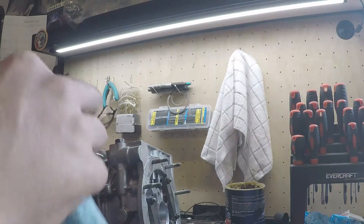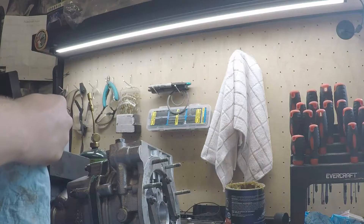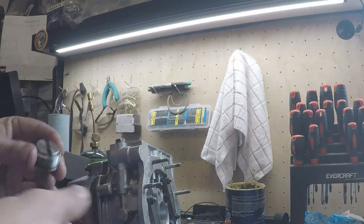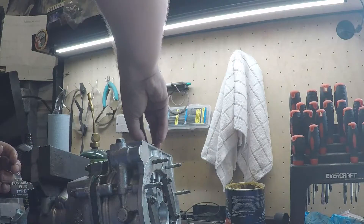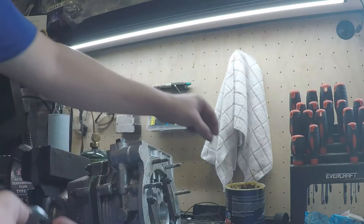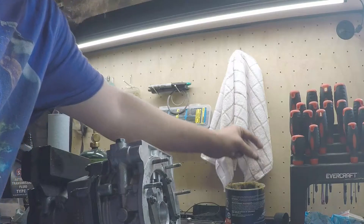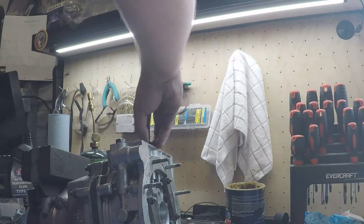Wipe this o-ring down with a little bit of fluid — wipe it down in here just like that. Put that back in there like so. Better yet, I'll show you another trick: you have a little bit of grease — not a whole lot, you're not really needed with something like this — put a little bit of grease on it, put it down in there. That way you know for sure it ain't going to go anywhere so it doesn't bounce around.